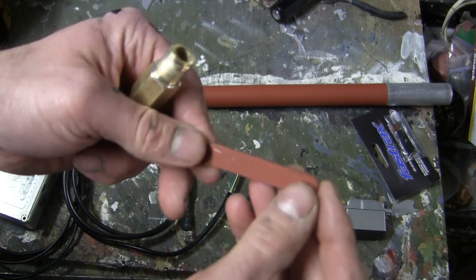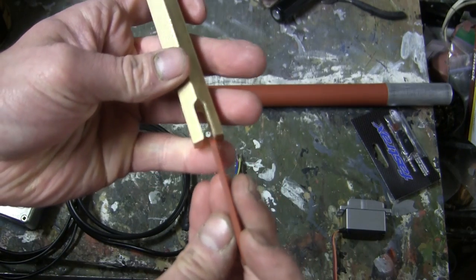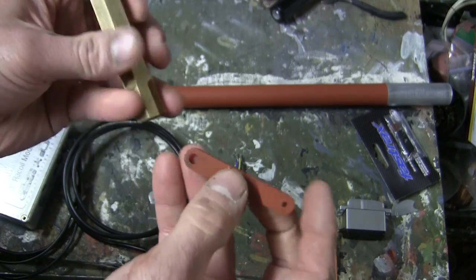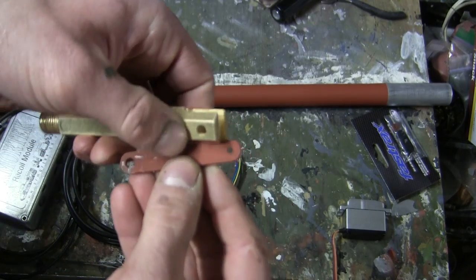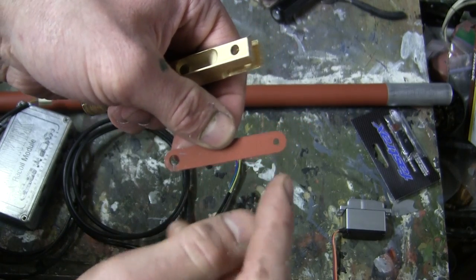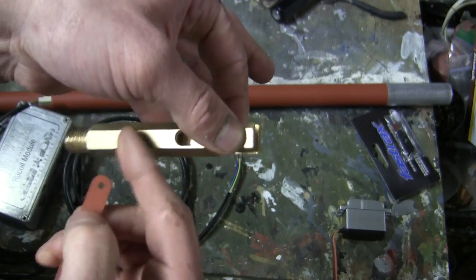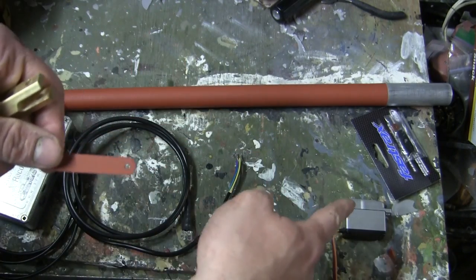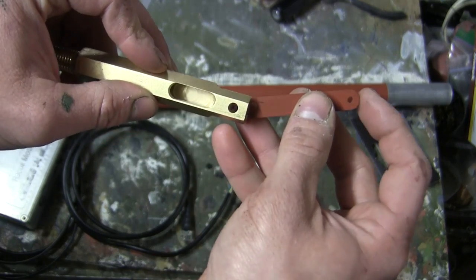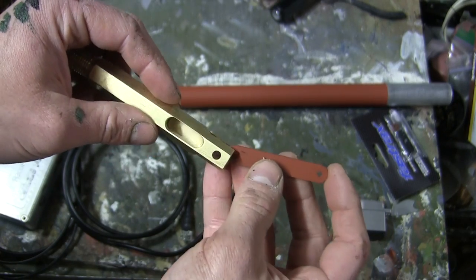The swinging link is made out of a piece of steel. It's laser cut and is nicely machined in that it fits perfectly inside of the action. Now, if we notice, the piece is not symmetrical as there are two sides of holes, the larger hole and the smaller hole. This is done to prevent confusion as the larger hole is for mounting onto the brass extension, while the smaller holes are for mounting to the servo. Once the system is fully completed, it will have a toggle action similar to what you would find on a German Luger.